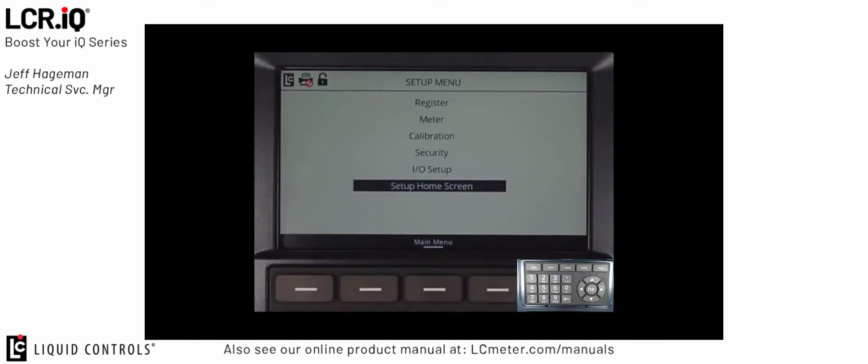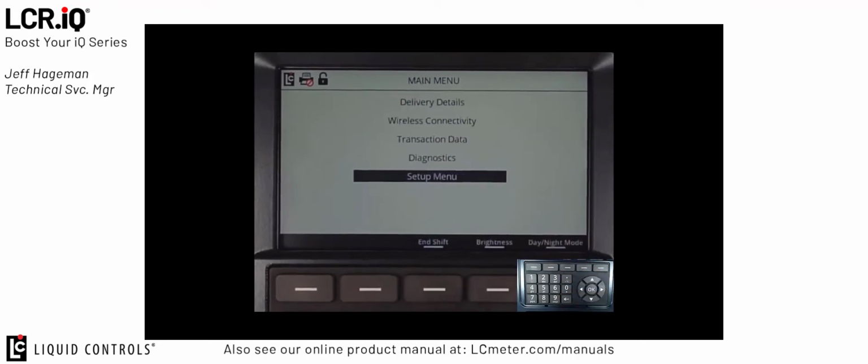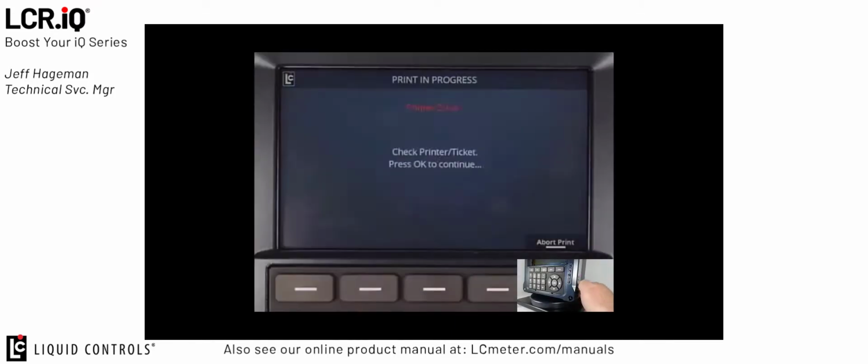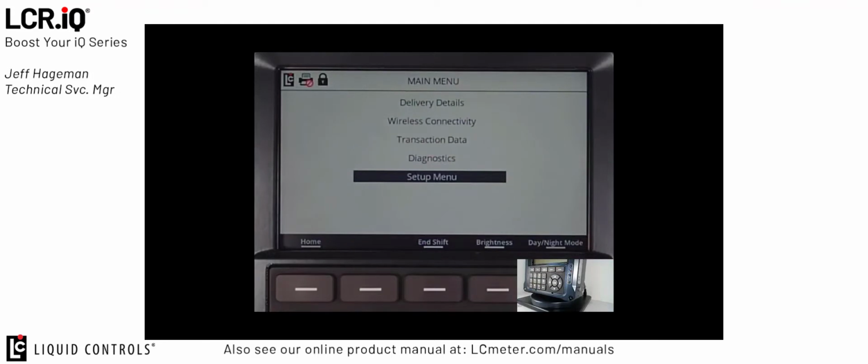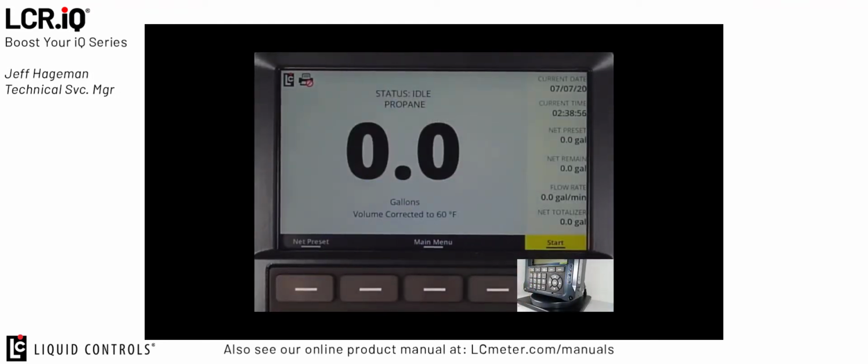Now that we've completed our basic configuration setup for LPG in the US market, we want to exit back to the main menu by pressing the main menu button. Next, we'll want to put the register back in the normal delivery mode. Locate the bolt on the side of the housing and thread it back in until the bolt is snug against the front cover of the housing. At this point, it will try to print a ticket if you have a ticket printer connected. If you don't, just press the Abort button and this will bring you back to the main menu screen. Now press the home screen button and you'll be back at the main home screen.